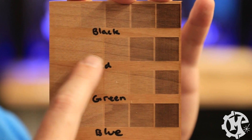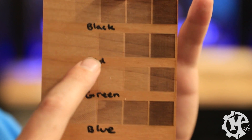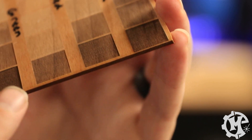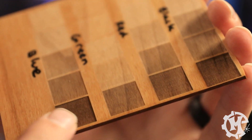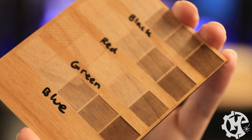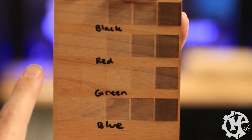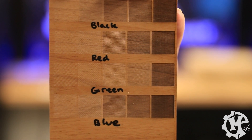On wood it doesn't look so drastic — it basically just changes the shade and the depth. On black it's a little bit deeper with more of a groove, on red it's a little bit lighter, green is even lighter, and then blue gets deeper again. So depending on the look you're going for, you can adjust your color and your DPI to get those different effects. Keep in mind this may depend on your machine and how it's set up.